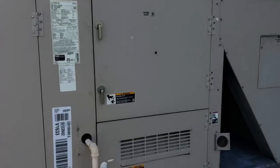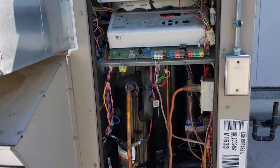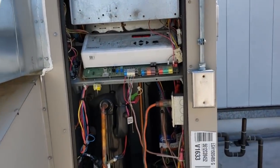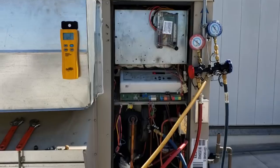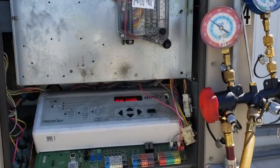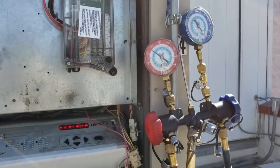First thing first, we're going to get this grounded one recovered and diagnose the other one. We're going to try to leave this unit running as long as possible because this is their kitchen AC, but there will be a point when I have to shut the whole thing down. We're getting started on our recovery — I've got the Appion Megaflow to make it go faster, with some gauges on there just to tell me the pressures.